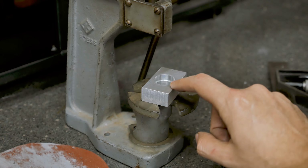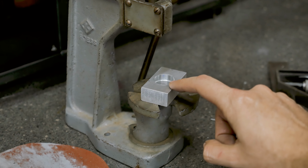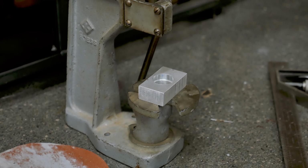also went about 2.5 thou under for the OD. It's going to be a little tighter of a fit, so I'm going to heat this up with a torch, and I also have the bearing in the freezer right now, so hopefully that'll give me a little bit more wiggle room. This Harbor Freight press, as cute as it is, isn't very strong, so wish me luck.